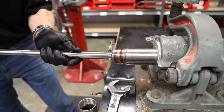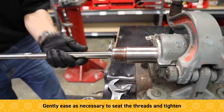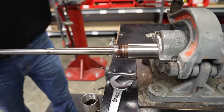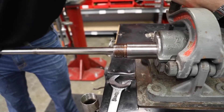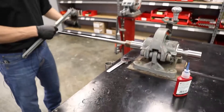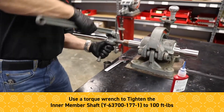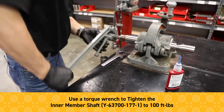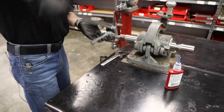After applying copper coat to the end of the inner member shaft and shoulder, we want to place blue Loctite on the threads, then install into the end of the anti-rotation. Sometimes a little bit of wiggling to get those threads to go around the seal is required. Tighten it up — this is 100 foot-pounds.